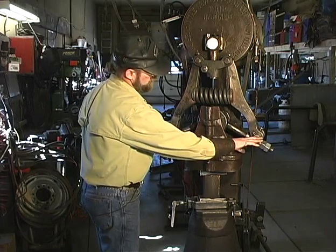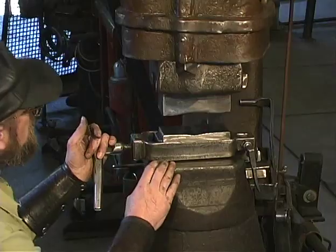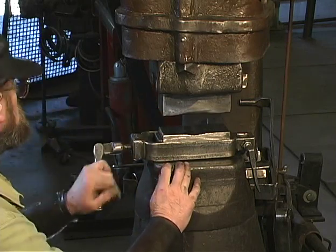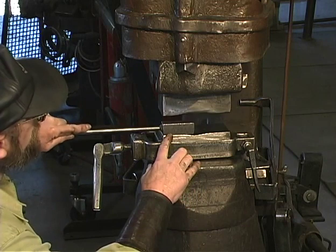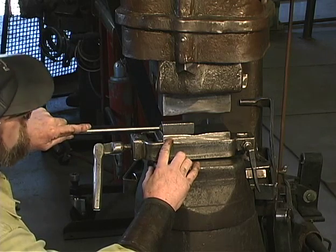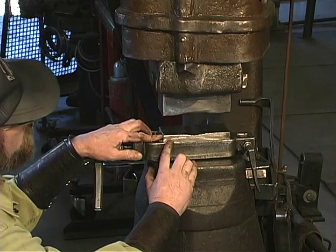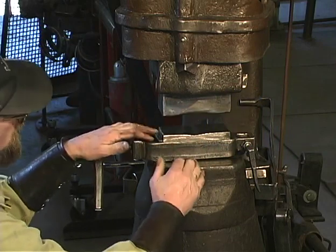The hammer should strike your work with the links just very slightly below horizontal. In the Little Giant 100-pound hammer, with the spring adjusted to basic load and links horizontal, the pitman is adjusted so that the top die is about 2 inches off the bottom die. This means that with the hammer running at speed, the top die will strike a 1-inch piece of work with maximum force — the crank pin will be at 5 o'clock, with a very slight downward deflection of the links. The hammer will strike the bottom die with less force, with the crank pin at 5:30 and a greater downward deflection, so the spring is already beginning to rob power from the hammer.